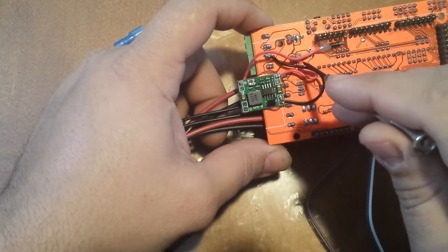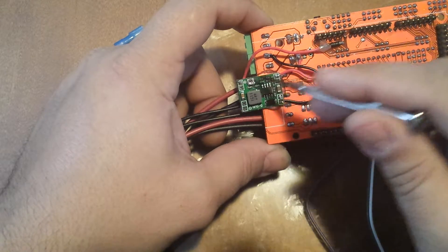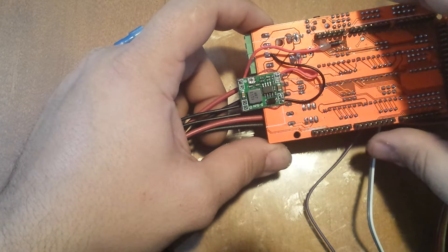I'm using this to step down to 24 volts off the board — ground right there, 24 volts in. I'm using this to step it down to 12, feeding it back to the diode so I don't backfeed anything. And this is now going to power the Arduino on its own.